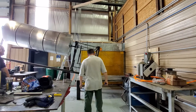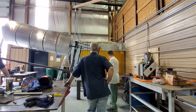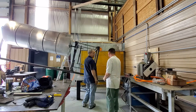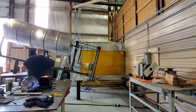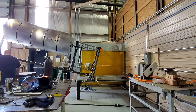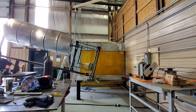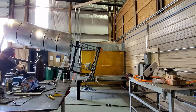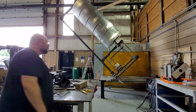How's our fulcrum? It's not moving, it is going kind of that way. But we're already past it. When we do it in the truck, we're going to have something different anyway. We're going to keep this in fast mode so you're not bored to death, but we're using the stronger, faster electric winch to bring Harmony up about 75% to the tipping point where it's sort of perfectly balanced and any more it would actually fall forward as it finishes standing upright. We don't want that because that would damage things badly and be dangerous. So we're welding a D-ring onto the back, and then we're going to use a hand winch — actually called a worm winch — to safely lay it down the rest of the way as we get it to that tipping point.